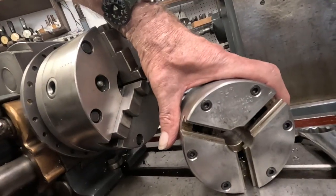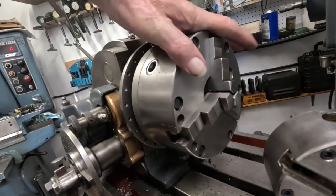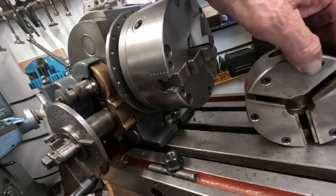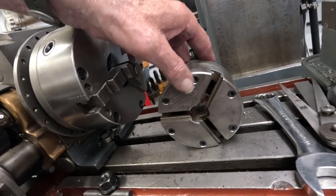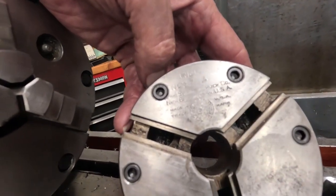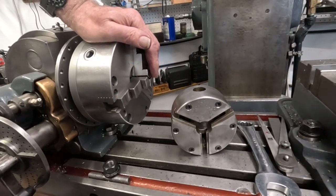Now I have a front-mounting chuck — see that, it's got six screws in it. All I did was follow the holes in the back, just lined it up and punched it through, then counter-sunk the socket-head quarter-inch screws with a three-eighths. It came out looking factory — didn't even mess with the writing on the front of it. It's a Skinner chuck, steel body. It's quite a special piece.